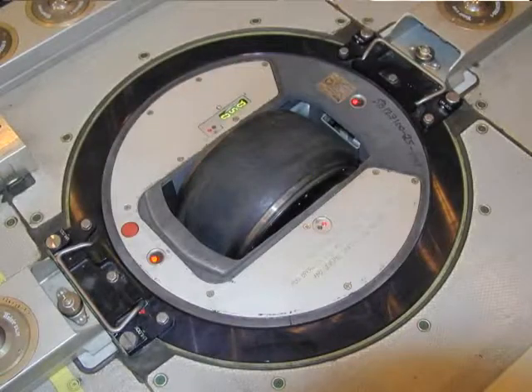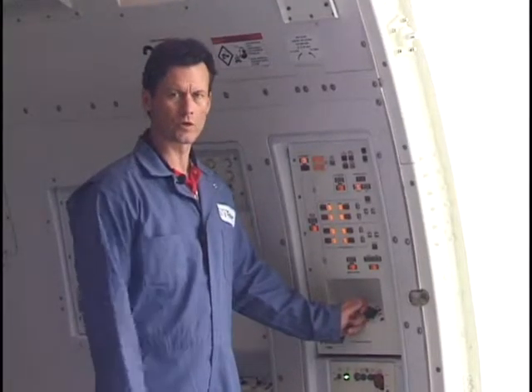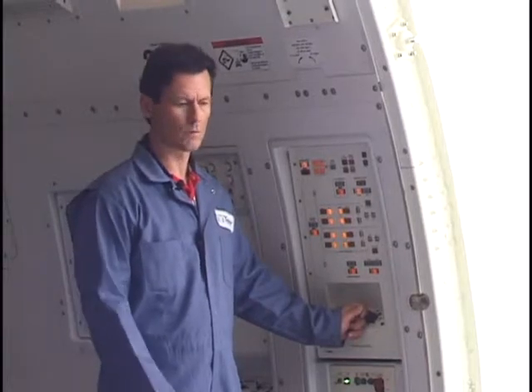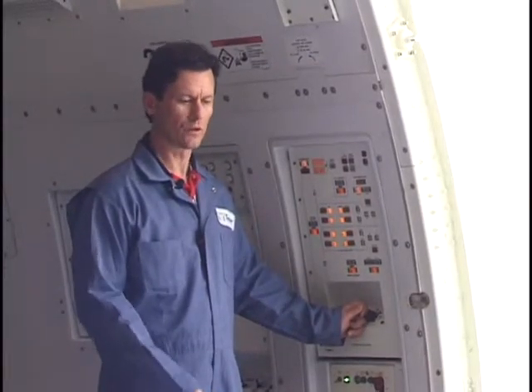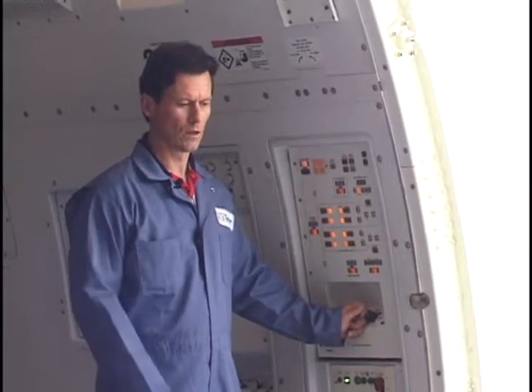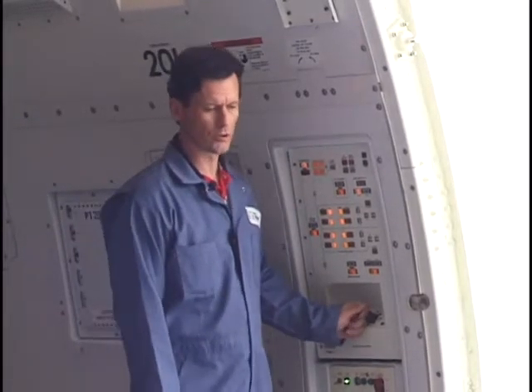The 127-100-1 PDU is infrared sensor activated. Even though the joystick is depressed in the down direction for loading, the PDU is energized but it is waiting for a command signal from the infrared sensor. One or more sensors have to be covered in order to have the PDU energized.